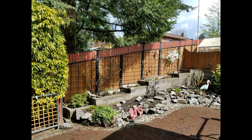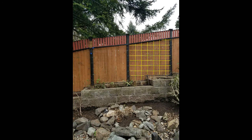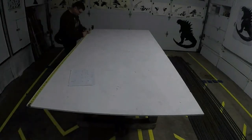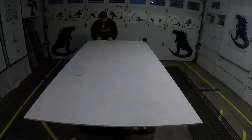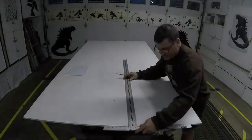Now, let's build some trellis. Because of the weight, you'll want to build this in sections. Each section will have its own frame and be independently removable. This will allow you to do maintenance on the fence behind the trellis. The outside frame is going to be an irregular shape, so we'll weld that in place right on the fence. But the trellis internals are all going to be identical, so I'll do that on a template. To build the template, I primed a 4 by 8 sheet of plywood, then measured out how big I want my squares — actually, the rectangles — then proceeded to draw in all the template lines.